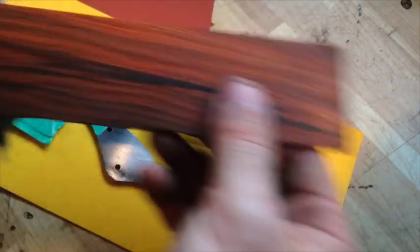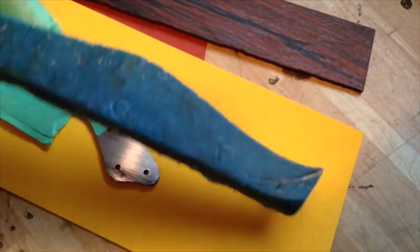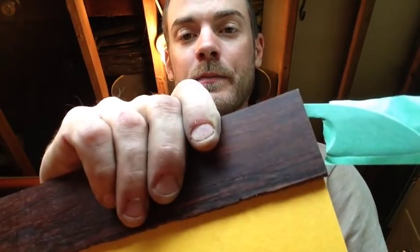I need to plane the handle material a little bit to get a nice flat mating surface, same with the blue micarta. Safety tip: when working with any kind of micarta, remember it's essentially fiberglass — wear breathing protection. Same goes for any fiberglass work, it's super toxic and the particles are extremely fine. So: blue micarta with white liners, that's easy. The cocobolo — let's call it that — with yellow liners, we're going for it. Next step is to trace out the tang onto both the liners and the handle material, then cut them out.